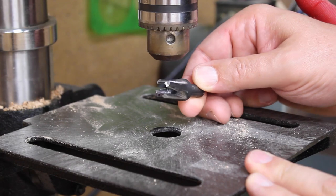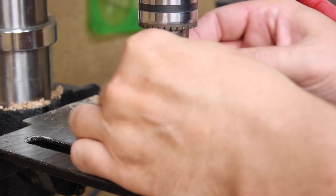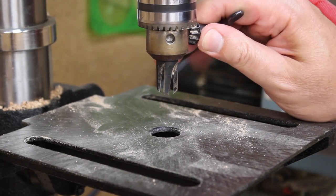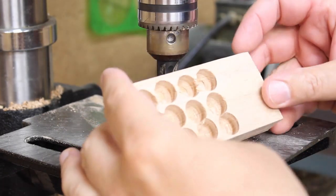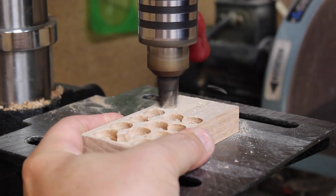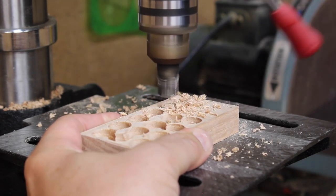Welcome back! This is our second part of building the tool chest. I'm using a plug cutter for a screw plug that will go and cover the screws, putting it into the drill press. I like this four-prong model — it basically allows you to make your own screw plugs. I sharpened it up just using a diamond file on it. Cut as many as you need.